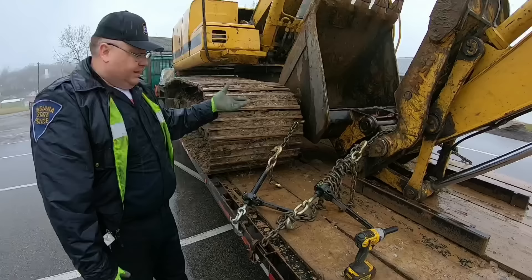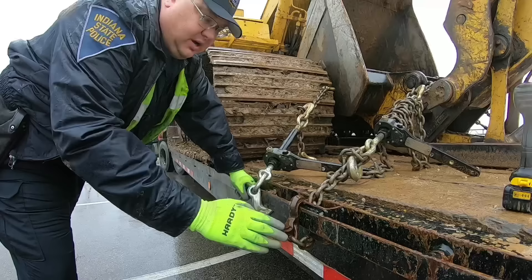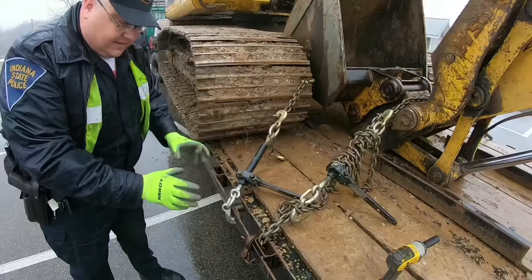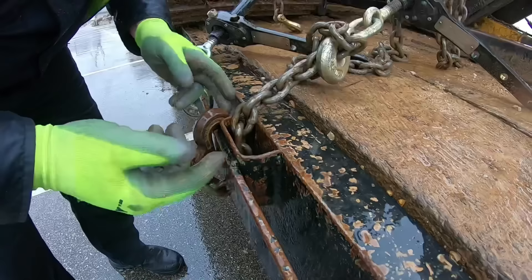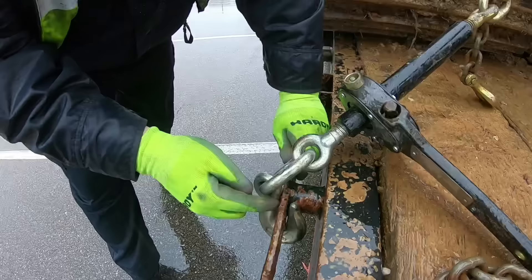You get stopped for a DOT inspection, the machine may have shifted and settled a little bit, and now you've got one loose — that extra chain helps. Another thing people ask about is attaching to the rub rail and the trailer. Big question: can you secure something to the rub rail and can it be outside the rub rail? Yes, in the continental United States you can attach to the rub rail. But you need to be vigilant on the pocket welds where it's attached — make sure there's no cracking.